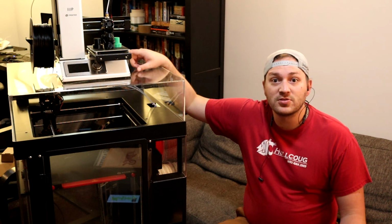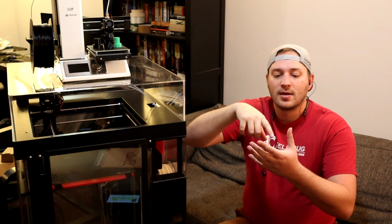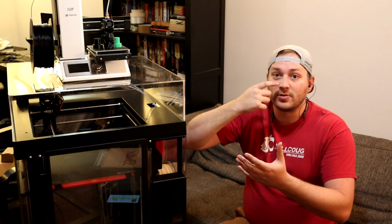Going outside of that, additive manufacturing is now starting to mainstream metal additive manufacturing. Metal additive manufacturing has a ton of processes, from electron beam additive manufacturing to something that looks a lot like this. In fact, it uses fairly similar technology to a fused deposition modeling type printer. It just prints a filament that is enough plastic to hold it together, and then everything else is metal.